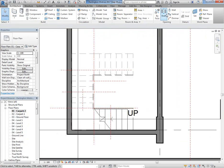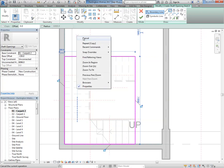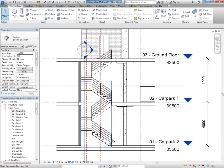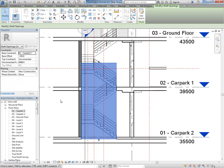Now I can make my shaft. I'll start with a rectangle, starting on the corner of the stairs and bringing it down to the corner of the wall — that would basically make a hole for the stairs to rise through and still give you the ability to step onto the floor from both ends. I'll finish it and show you there is one other little issue. I've cut my hole with the default settings — you can see it's on a base offset of minus 150 starting on that level, so it's gone into the slab.